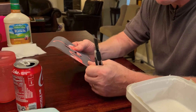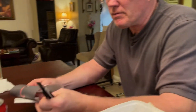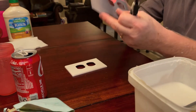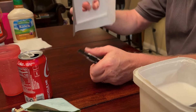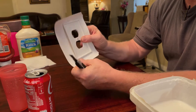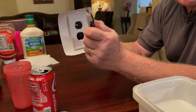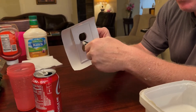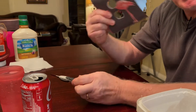Sometimes a customer wants you to wallpaper their switch plate covers. You take the wallpaper and you put it on the switch plate cover. Turn it around and you'll see the perfect outline against which to roll your blade or slide your blade around the opening to get the perfect fit. Now here's the trick.